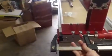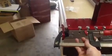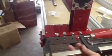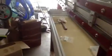In order to do this, what I did was move the gantry all the way up against the bumpers. I made sure to touch the bumpers on both of them. I took a little bar clamp, stuck it around the front of this bumper right here, and then put it on the brush rail there. This holds the carriage up against the bumper — not a lot of pressure. Just turn it until you start to see the bumper compress and back it off about a quarter turn. Do that to both of these little gantry risers.